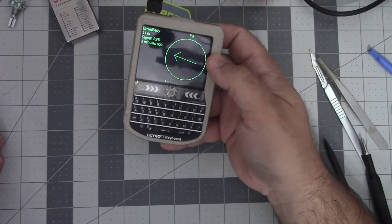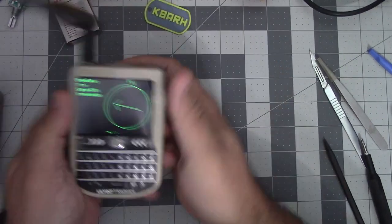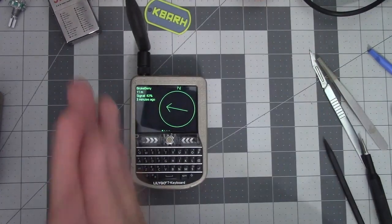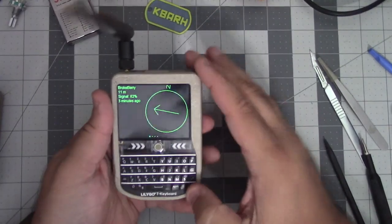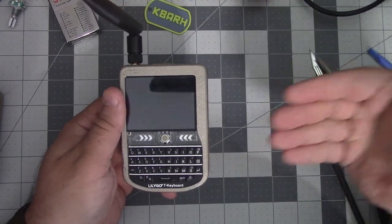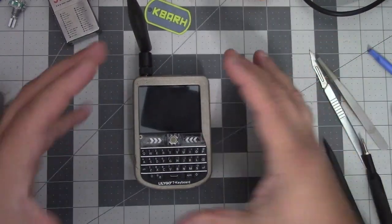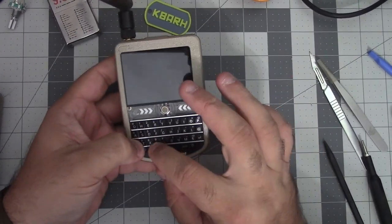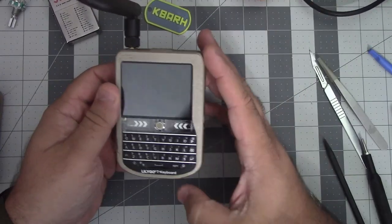So that just lowers the barrier to entry for somebody to pick this up and start typing, and they know it goes to your specific talk group. So that's just a configuration thing. It's a preference thing. There's still the ability to use those channels on here. I'm going to include a laminated card with the little pack that I'm making that's going to have a radio and everything in it that explains, hey, if you need to change to long fast or something, use Alt-C-T, Alt-C-T, and then you can scroll and change it to that.